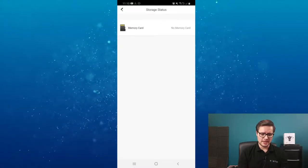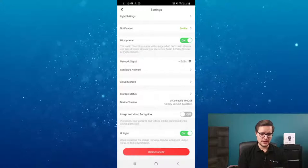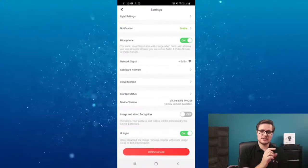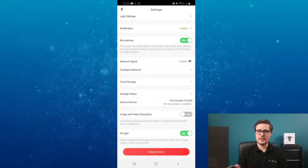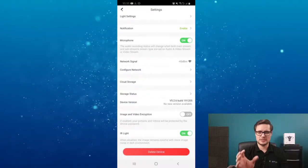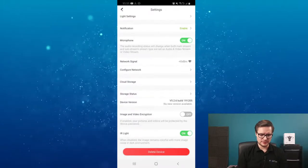There's no memory card included, so I'd recommend putting in an SD card. You can also record the picture to your NVR recorder. To do that, find out the IP address of your Pyronix light camera using the SADP software. The password for your device is actually the verification code on the sticker on the side of the unit, next to the QR code. The same applies to the WiFi doorbell - the verification code is the password for connecting to your recorder.